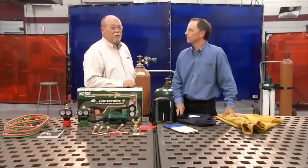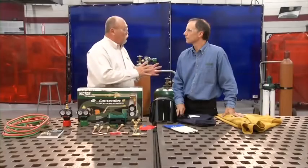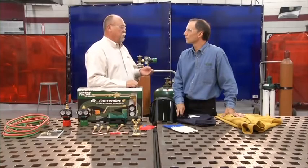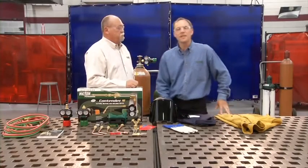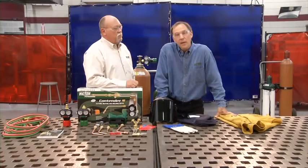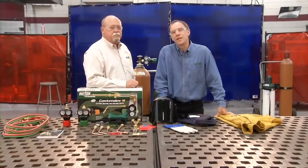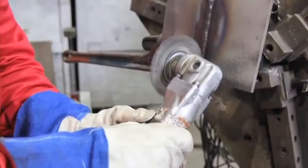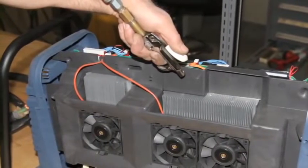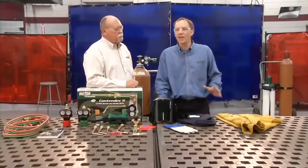Oxygen comes in many containers: it can be a compressed cylinder, a bundle of cylinders called a bank or six-pack or twelve-pack, a liquid container (liquid oxygen), portable containers, pipelines, tube trailers, or a large bulk tank like those seen at hospitals. The biggest mistake is to use oxygen in place of compressed air. You never want to do this because it could create a fire hazard. Areas where oxygen gets misused most often include using it with pneumatic tools, blowing dust off clothing or your work area, or using it as ventilation in place of air.